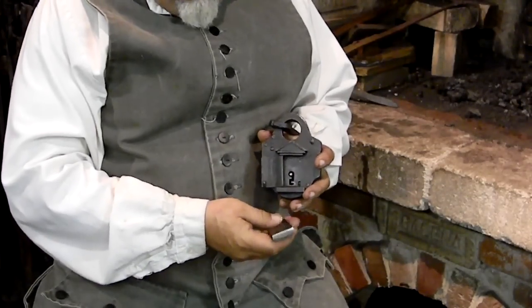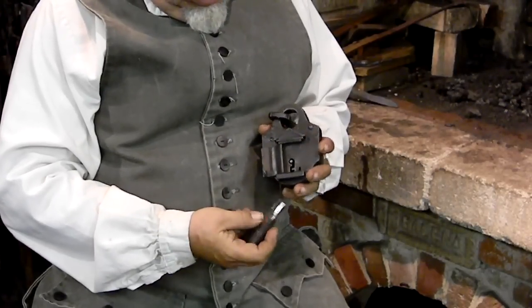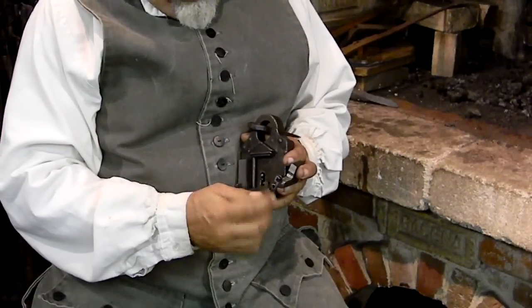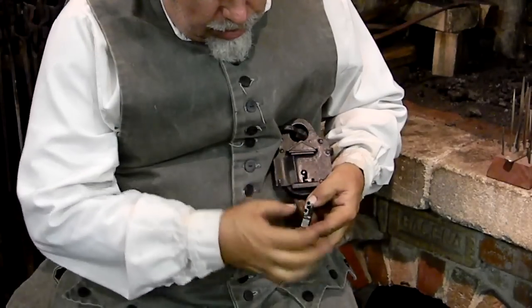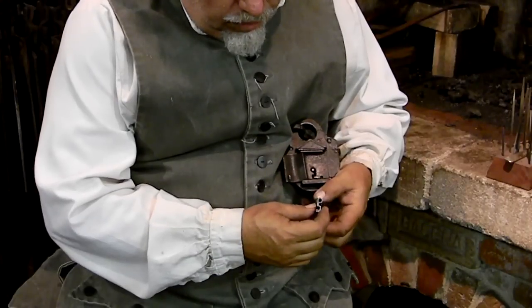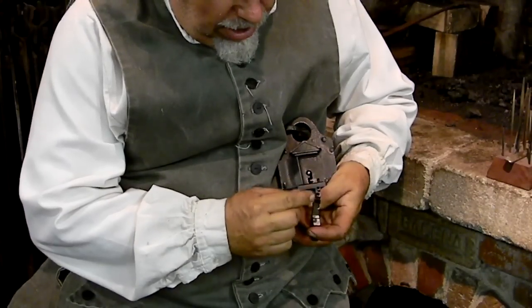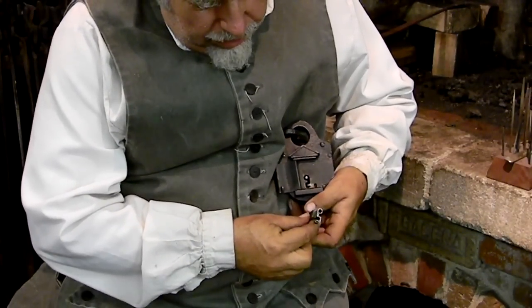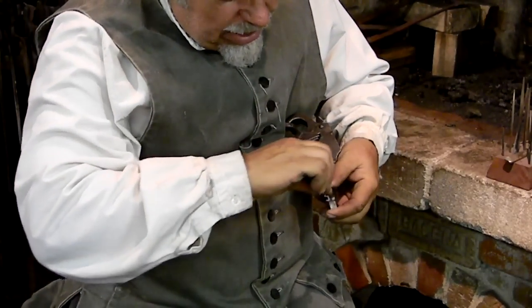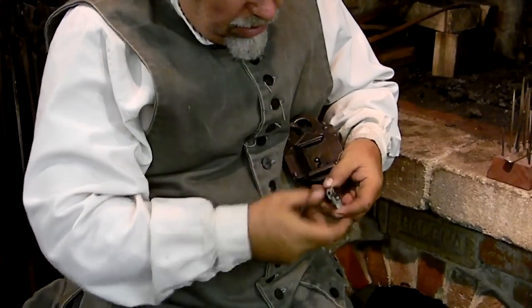I took a block of steel — half inch by about an inch and a quarter — and I started to cut away at the metal. First, I had to drill the hole for the barrel, then reduce the metal by grinding on a grinding wheel. Then I had to mill the slot so it could make that zigzag, milling each slot in there. Then, using small files, I cleaned up all that work — the grinding and milling — until I created a round barrel, as you can see.